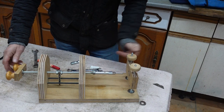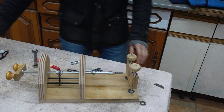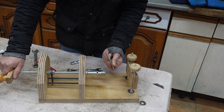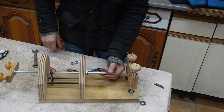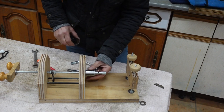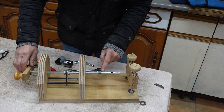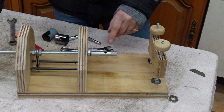So here we are with an answer to what was a nightmare problem for me, and it's in fact better than it was if I was going to use the chuck. I'm really happy with this because I've got these bits now which are interchangeable and just somewhat easier to use by using this method. I've got my spring holders which go on there. Here's the smallest one. They're not going to get in the way of anything there. You just saw me now, I had a spring washer on that and a bit of thread lock as well, and I've locked that into place. Now this tube will just stay there permanently.